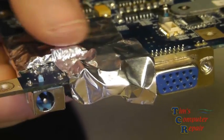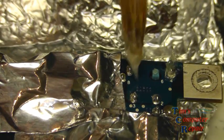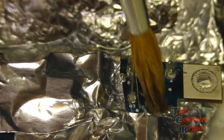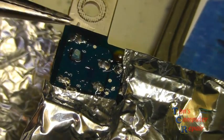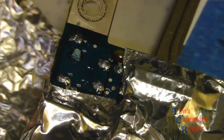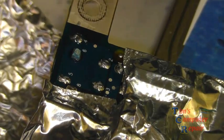Okay, I think we're ready now to start applying some heat. We're going to start off by applying some flux — be generous. The more flux the better; don't be scared to put plenty of flux on your solder joints. Now I'm just getting my plan of attack. I have the board elevated flat so I can take my pliers and work the jack out as I heat it up, because don't forget this power jack also has two clips on two sides. I also have aluminum foil on my table below just to be sure I don't burn my bench — we don't want to start a fire.